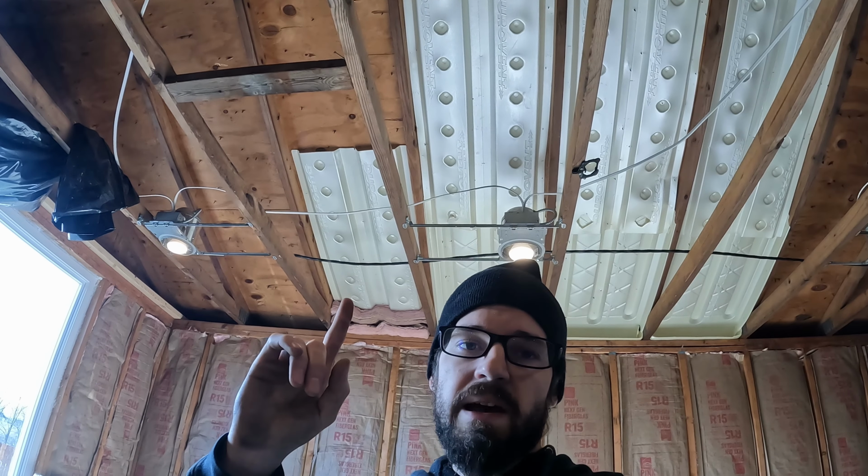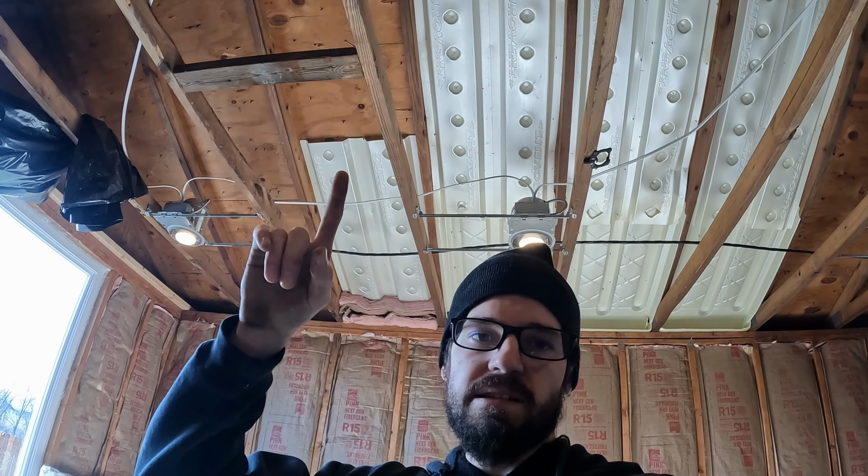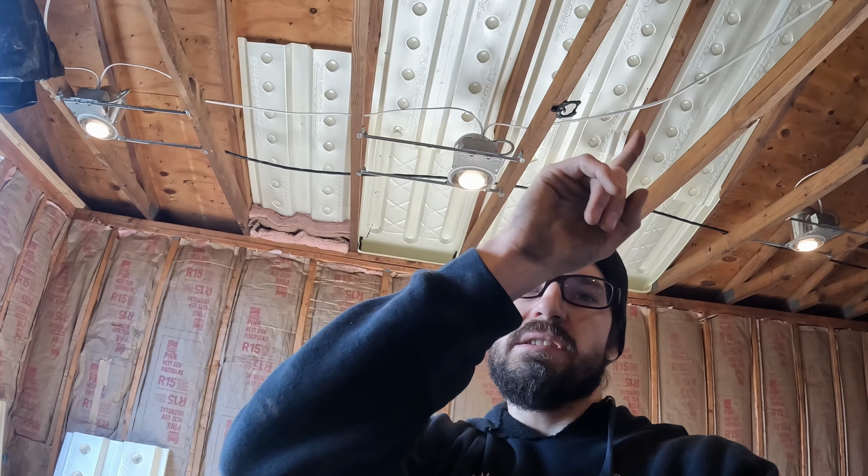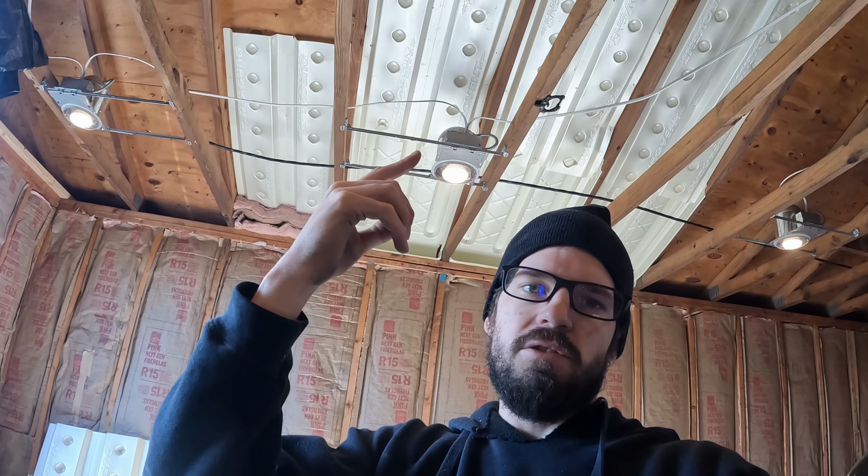So we have this one back here. I didn't put the extension on because that's simple. It's the same pattern, so you just put the new holes in there, staple them, and along you go. Since we're using two different types of Durovent products over here, the baffle included and then just the vent channel, I had to do a little bit of trial and error to match them up. So this is what I came up with.